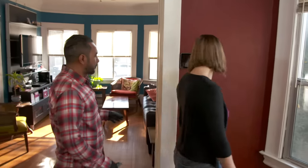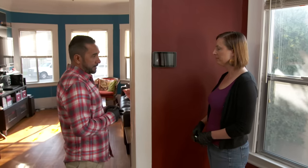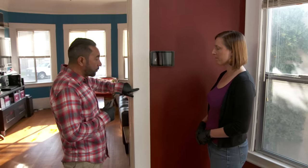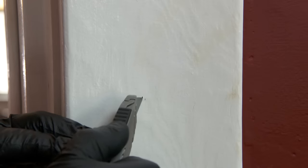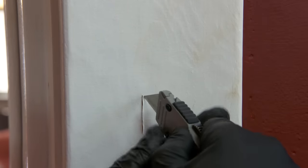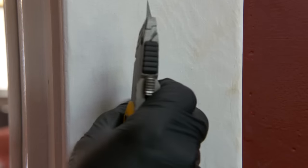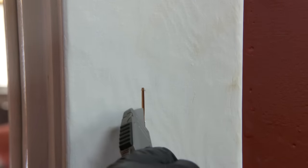Okay, Sara. Before we do any stripping on houses built before 1978, we have to test for lead. There are multiple coats of paint on this trim — we have to go all the way down to the first one. We'll make a little V-shape cut on this side and another one on this side. I can see the bare wood. Now let's test for lead.